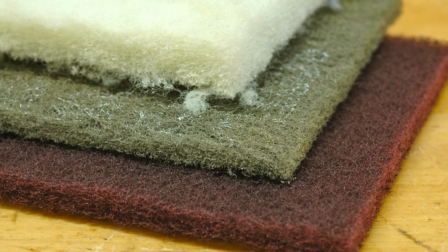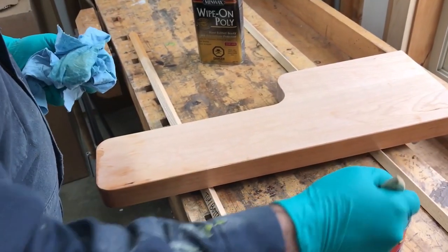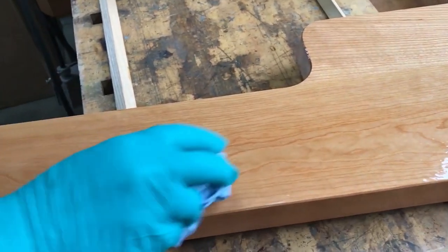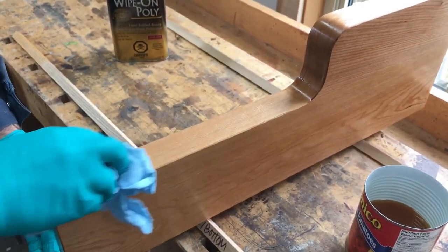So now you've got your chair and you've gotten rid of that ugly rough sandpaper surface — what are you going to do with it now? Well if this were my chair I would be finishing it with something called Wipe On Poly. This is a fairly unique product made by Minwax and it's essentially a very low viscosity urethane. But unlike regular urethane, which you brush on to form a kind of film on the wood, you put on the Wipe On Poly, let it soak in, and then gently wipe off any excess that exists above the surface, then set the chair aside and let it dry — usually about a day. Wipe On Poly is kind of like finishing oil except it's better and more reliable, drying quicker and harder with a little more strength.